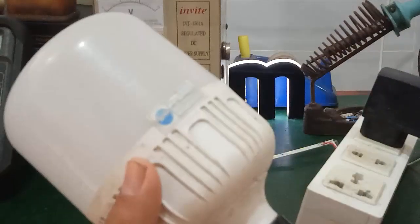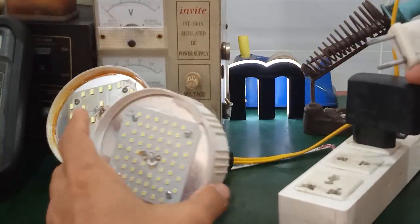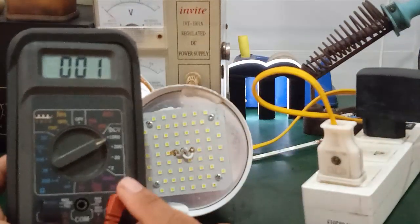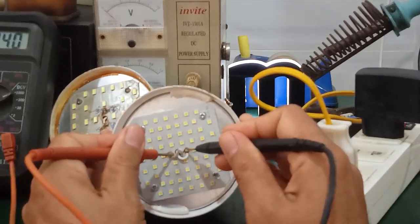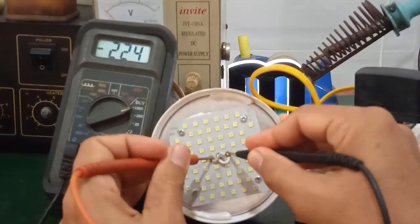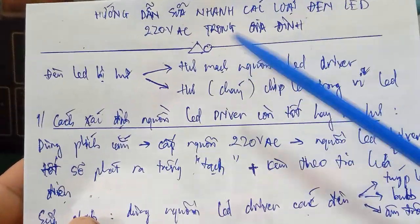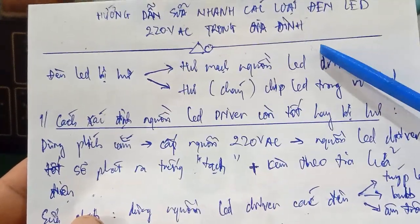As with the LED bulb lamp here — I'm not sure what's wrong with it. If you have a multimeter you can measure the voltage; if not, just plug it in. It sparks, so you can use the multimeter to measure the output voltage. It reads about 200V, confirming the LED driver is good. So this confirms the driver is fine and only the LED chip board needs to be checked.